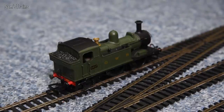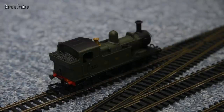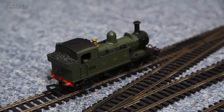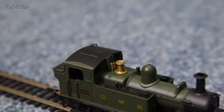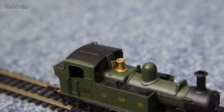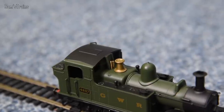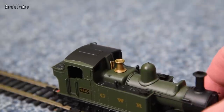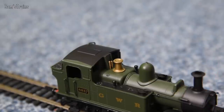It's had a couple of months to... oh there is smoke! Did you see it? Was that clear on camera? I've switched it back on - I can see smoke coming out of the cab windows interestingly. There is quite a bouquet coming off that now. But it's not a lot of smoke - it's definitely not doing what it was before. Obviously it's not completely open circuit. So I'm going to cut this off because I don't want it to be red hot when I take it apart. I don't want to burn my fingers on it again. Let's take a look and see what it's actually done to the motor and see if we can find out any more about it.